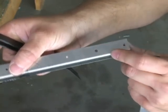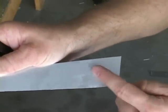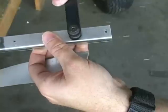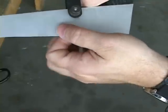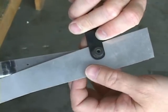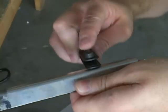Let's pretend that this hole right here is a hole we need to find. We want to cover it with this piece of sheet, but when I go to drill I can't see where the hole is. Using this tool, I'm going to place the little bump into that hole, then place the sheet over and drill into the bushing — it will locate that hole exactly where it is. I'm simply locking it in and then drilling through the bushing.